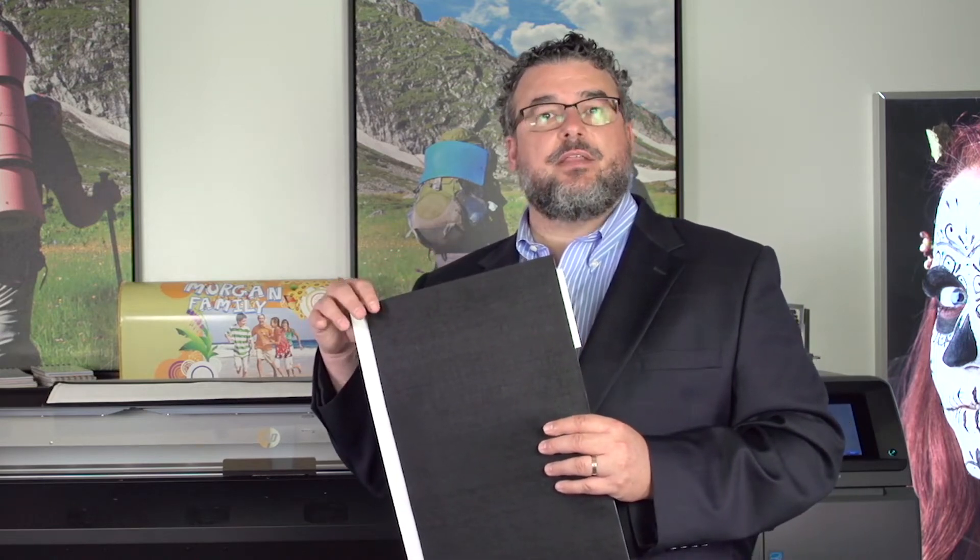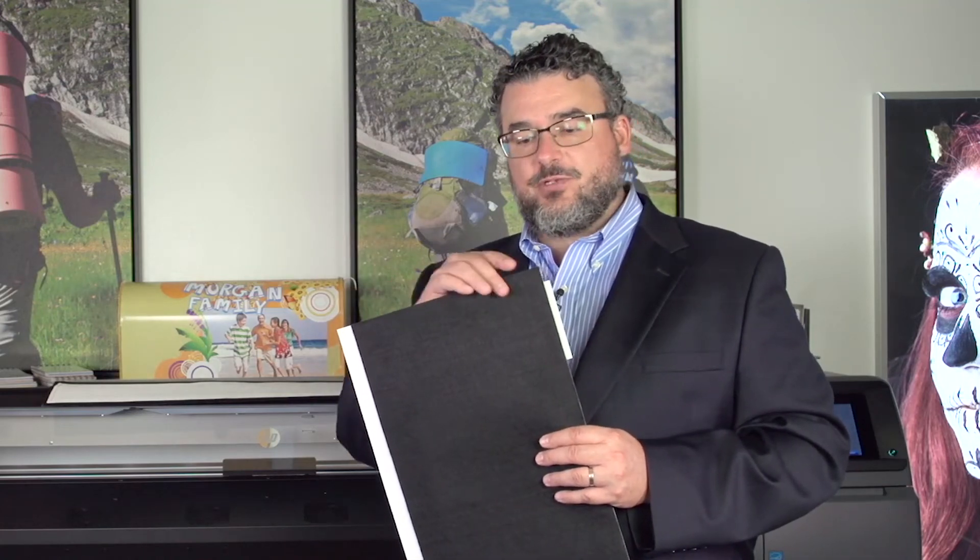These felt covers were designed to load onto the platen cover — and you have to use the take-up reel when running fabric across this. They capture that condensation so it can't get onto the platen and possibly slide down and drip on the fabric. That's what these condensation covers were for.